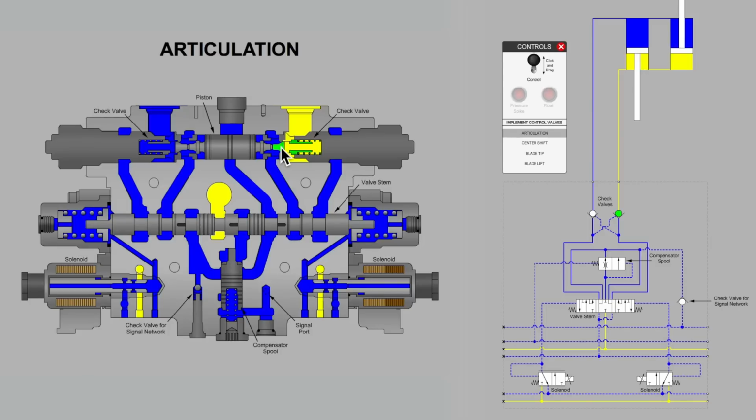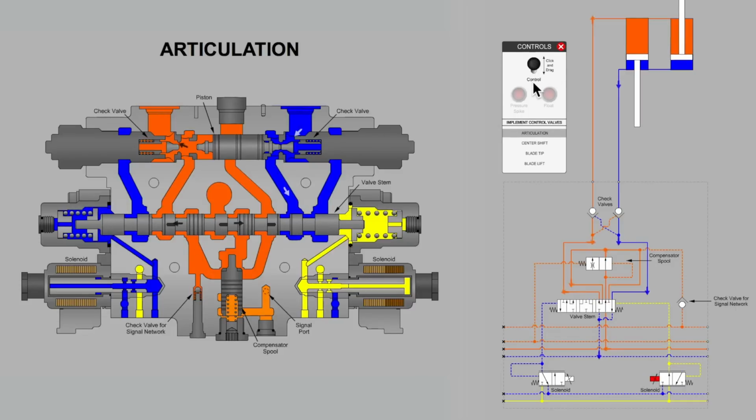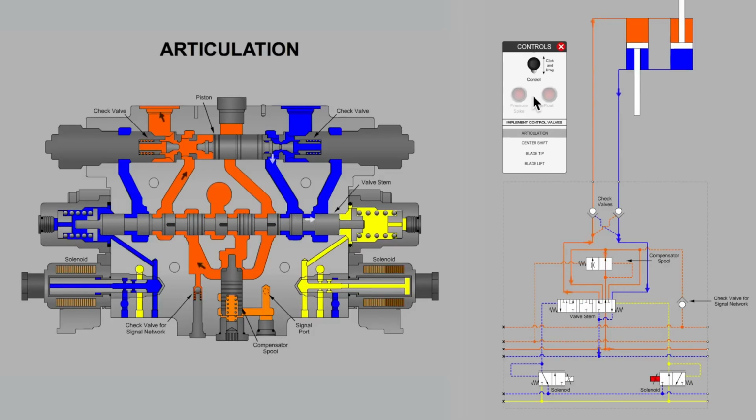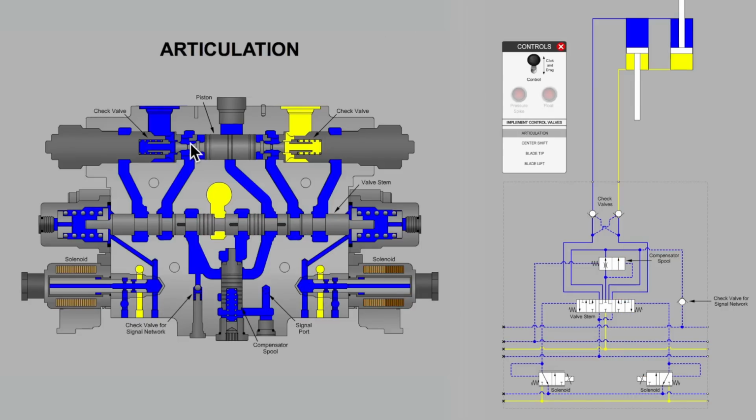We talked about the possibility of fluid coming back from the cylinders, perhaps containing a chunk of piston seal or a steel sliver from the worn cylinder itself getting stuck on the poppet and seat when the check valve goes to close, something that could certainly happen. The thing about that particular fault is that once the valve is moved in the opposite direction or even opened again in the same direction, quite often a chunk of contaminant that came to be lodged on a poppet and seat is cleared away.